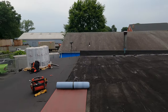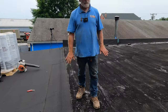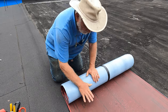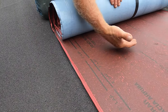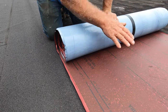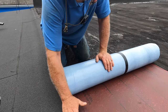I want to know where you start — at the bottom of the roof or the top? You always start at the bottom of a roof. If the roof is slanted down, you want to start at the bottom. The reason is, when you overlap another material, the water cannot run back up. It will always run over. Even if it's not sealed properly, water will not run back. You don't want to start at the top — then you're going to have the seams open and water can get underneath. So always start at the bottom.